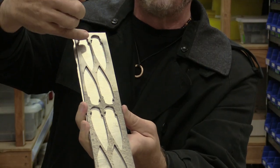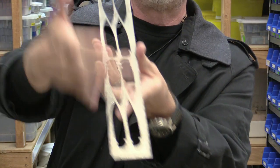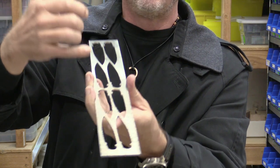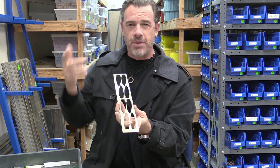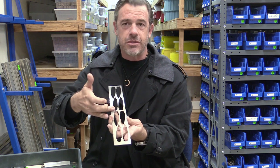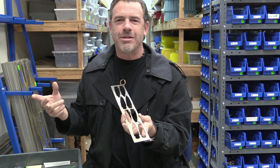So I want to zoom in a little bit, because what you'll see is that we just quickly dipped part of this piece of steel into an acid solution that reveals the pattern. So you can kind of see some of that pattern starting to emerge. This particular piece of steel is Hornet's Nest Damascus by Mike Norris in North Carolina. It's gorgeous stuff, and this Hornet's Nest pattern, he's the only guy in the world that makes it, and that's part of what makes it so fun.